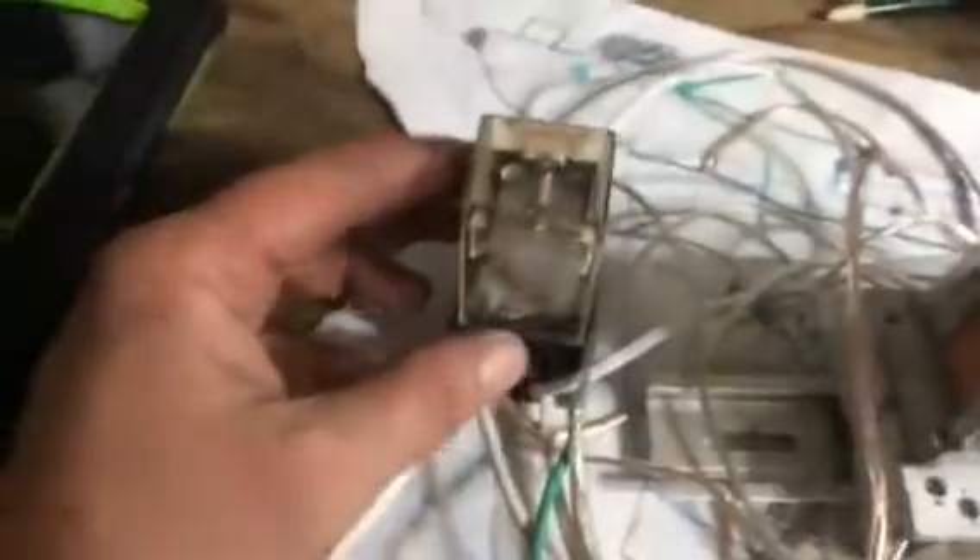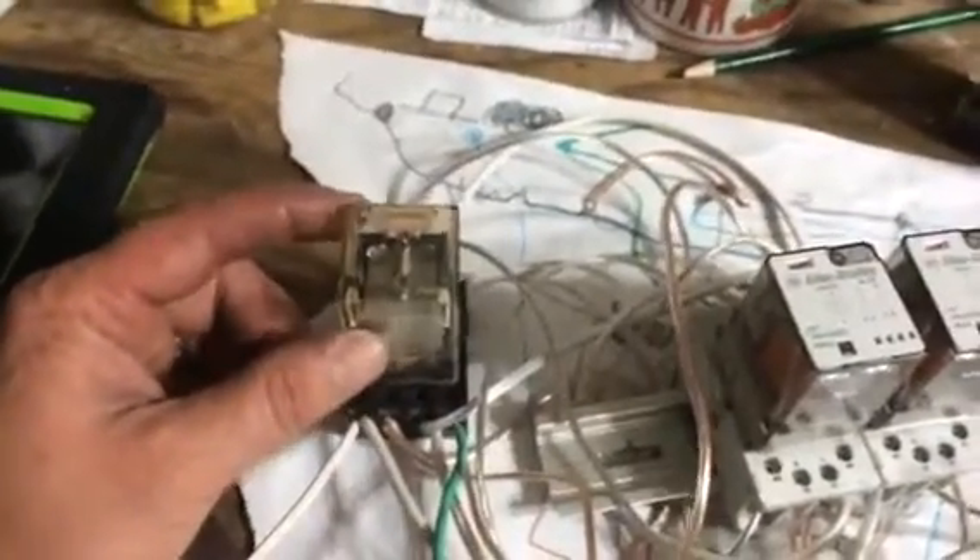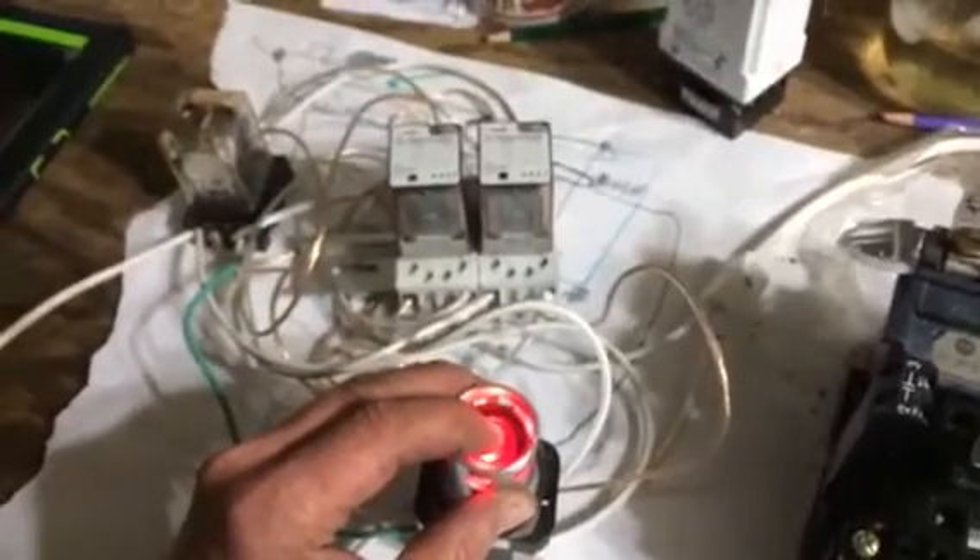This little secondary ice cube relay represents my starter. I was advised that a number one starter wasn't powerful enough to run the five horsepower motor, so I dug up a number two. I didn't want to experiment using the number two, so as a result I experimented using this old relay.